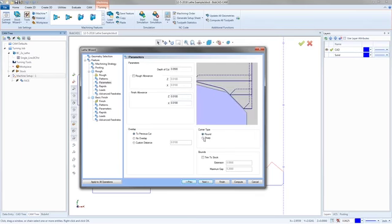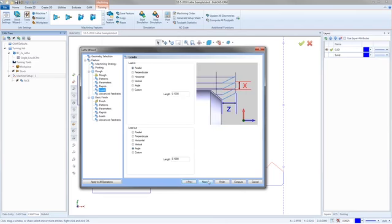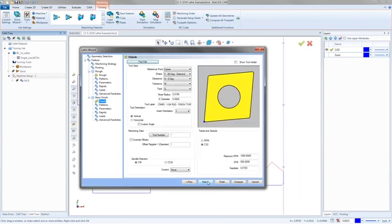And then we got our corner types. We can go round or sharp, trim to stock. I'll talk about that some other time. And then the rapids. So same kind of default rapids. I'm pretty much going to keep the defaults now just so we can get some tool pathing done on here. Leads I'm all right with. Advanced feed rates, I ain't changed them. And then this one, I'm just going to switch it up to a VNMG.